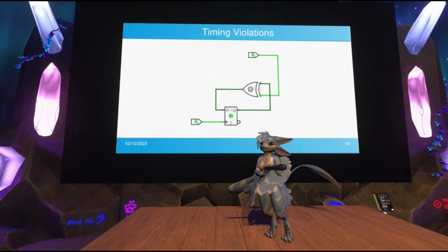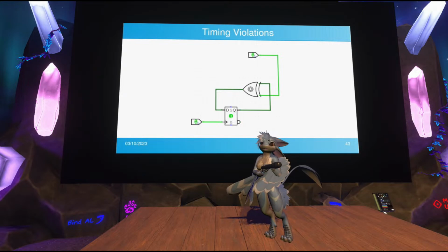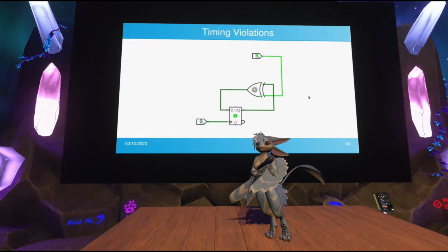So that's what you're seeing here. I'm indicating that even though with these two inputs of 0 and 1 the output of the gate should be a 1, it's still processing. It's waiting for its transistors to switch and its outputs to update, which is fine. Eventually, it's going to finish and present the next value to the flip-flop. But instead, we're going to consider this scenario: the next clock pulse arrives, and it arrives too early.